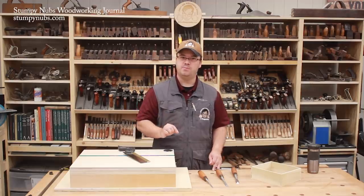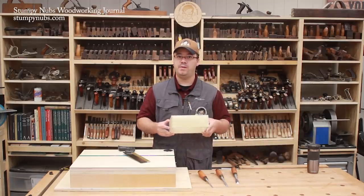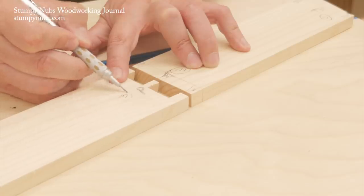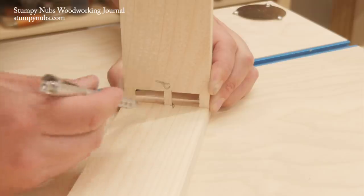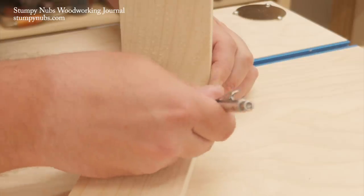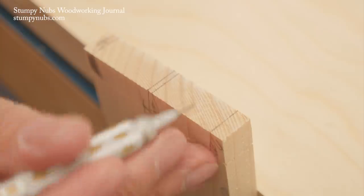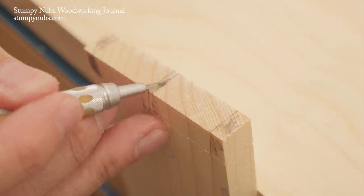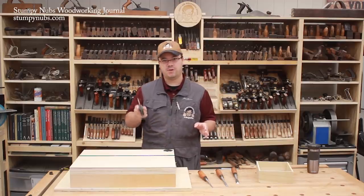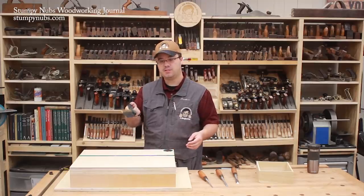At this point we should add to our labels because we will be custom cutting each group of tails to match the pins, and all of the pins are slightly different because you cut them by hand. So each corner of the box is numbered on both the pins and the tails half. Now the freshly cut pins are placed on top of the mating tails board with the labels facing inward just as they would be on the assembled box. Hold carefully so nothing moves as you trace each pin with a fine mechanical pencil or a knife. Use a square to extend the lines across the end grain and mark the waste areas, which are the small triangular sections this time.